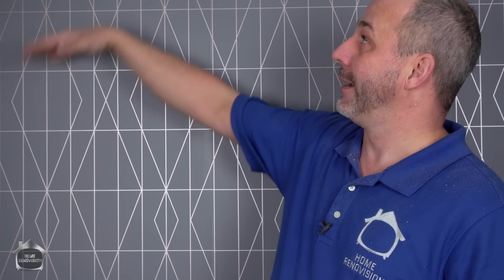Now what we're going to do is we have a 96-inch, almost 96-inch ceiling. So we're going to just cut all of them off at 95. Because we're doing the 1x6, we're also going to put a shelf at the very top underneath that 1x5, okay? That'll give it a nice close that off. We won't see the edge of the ceiling and the ugly wallpaper mistake I made up there. But what it does is it contains everything, defines everything, makes it a really nice look, quality space.